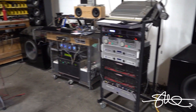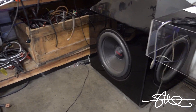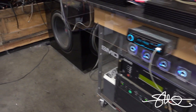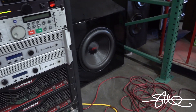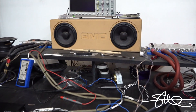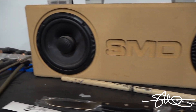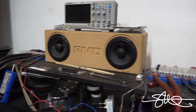So you're aware what those amps are hooked up to right now — I got the bass amp hooked up to these two 18s right here, which each have two passive radiators supporting them, one on each side. These 18s are like 3,500 watts RMS a piece, so the amp is not going to be able to push them straight out of the box like you would think, but we will get an idea what they sound like. The highs are hooked up to my test bench — mids and highs right here — this little box. These are CT Sounds coaxials. They've always been in here, they sound great, I love them. No reason to change them right this second.